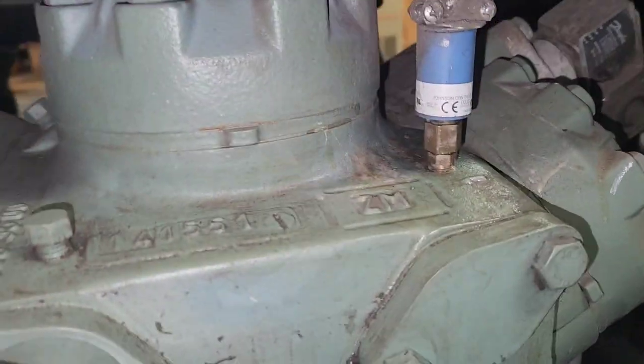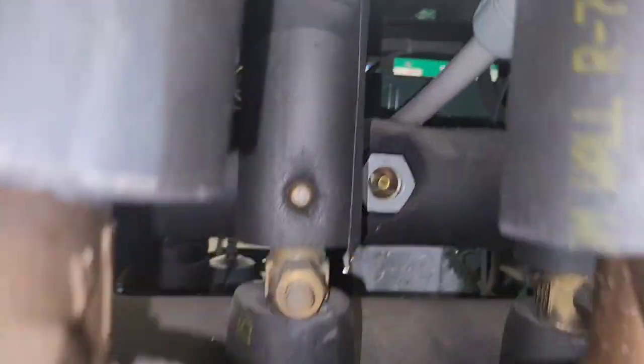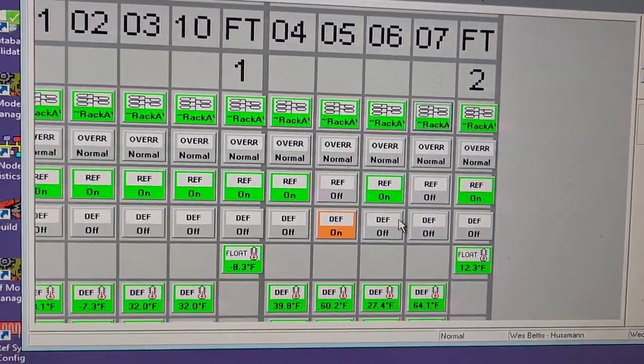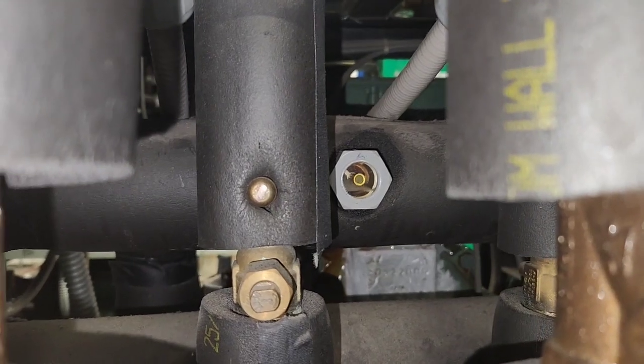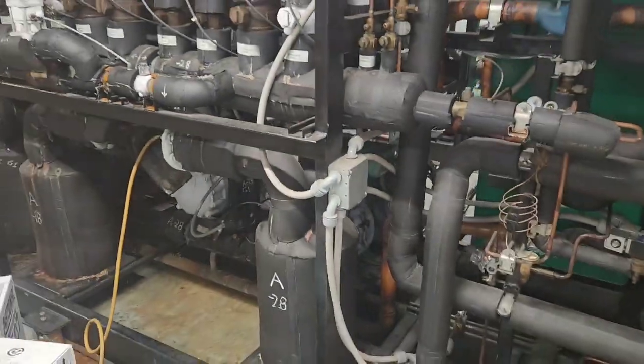And now we're going back up again since we're out of liquid - 36.9, it was just 36.8. So I had a refrigerant leak over here on my high pressure switch. I fixed it just by tightening it and now I'm charging it up. I had two circuits in defrost just now - that's why they looked so bad. You shouldn't have two of them on at the same time, otherwise that kind of stuff happens and you'll have problems with refrigeration. Anyways, that's it - hope my video helps, like and subscribe if you haven't already.